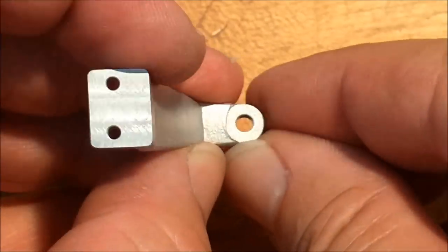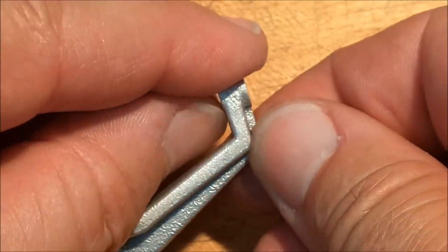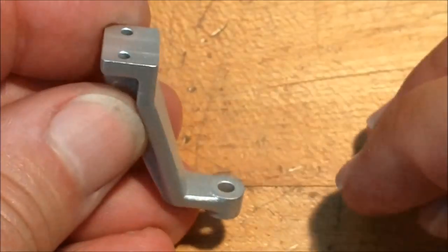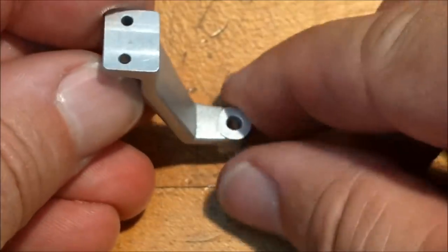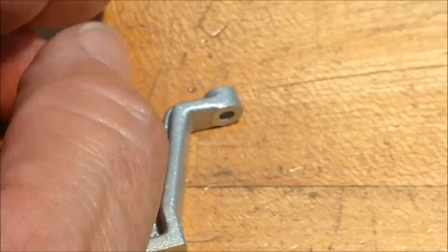There's going to be a nylon bushing there pressed against the pulley. We still have some projection right here, which is good. Distance-wise, it is right where it should be according to spec. This is about 3/4 of a millimeter out side to side, but I can adjust that on the assembly level and still get away with it. So that's what I'm going to do.